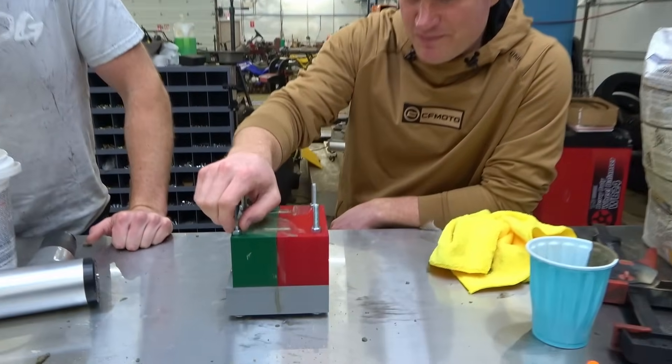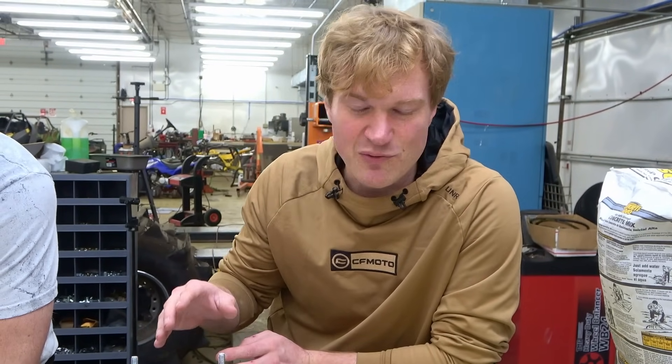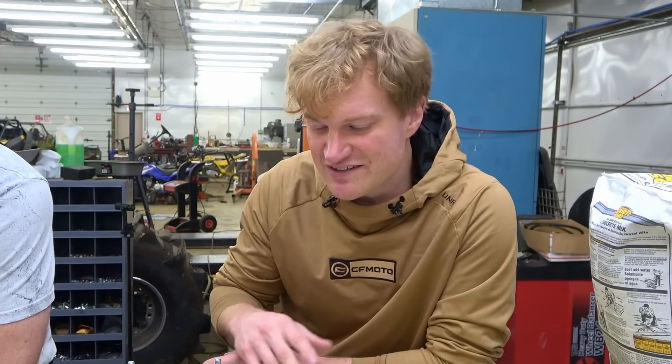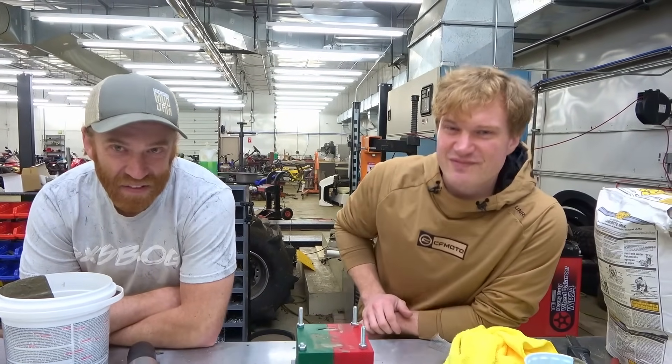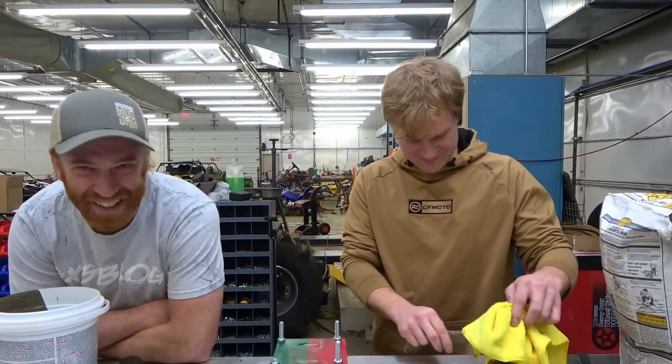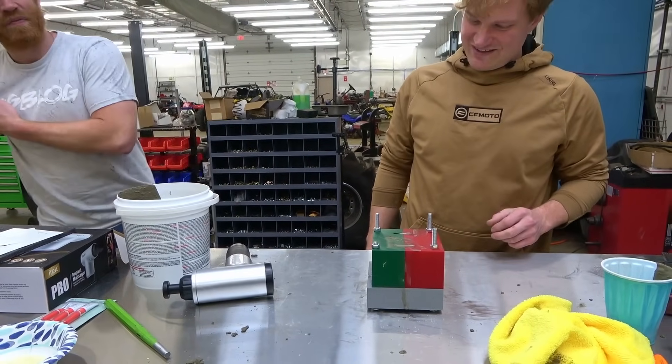It's pretty much ready to go. The thing about concrete is how long it cures actually matters. Letting it cure slower is better — it has more time to recrystallize, and that's how you get really strong concrete. So I'm probably going to put this in a cool corner of the room, maybe even put a cup of water next to it to keep it as humid as possible, and let it cure over the weekend — just make it go as slow as I can. Hopefully that means it's strong. Now that's the opposite of what I would have thought. Concrete doesn't actually dry — it cures. It'll actually cure it underwater, so you don't want it to dry too fast. That practical fact is one of the few useful things I got out of college.